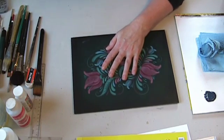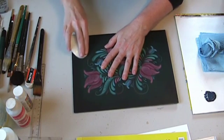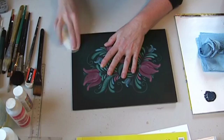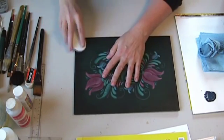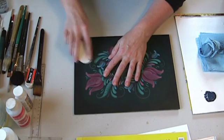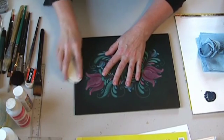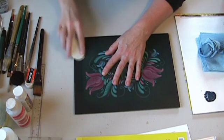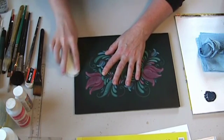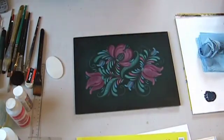And what you'll do is you'll just keep kind of wet sanding it. You start seeing those streaks go away. Okay, still no color on my piece. And that's a good thing. I'm going to be careful if you have any raised bumps like we talked about. And this is going to knock this bad finish down. It's also going to make it very, very fine. Very nice finish. Okay, for the sake of argument, let's say that we're done.